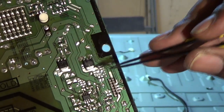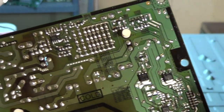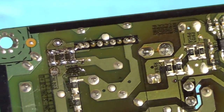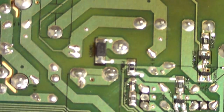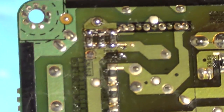Also check these little surface-mount FETs - FET stands for field effect transistor. But what I actually saw was this: right at my plug for the LEDs, I've got three burnt-up resistors. Look at that - one, two, three. They're burnt up, you can't even read them. They should look like the others with the writing on them. I believe what happened is they were drawing too much current because only five, six, seven, ten LEDs would light up while the others were shorted. That's what blew these resistors.